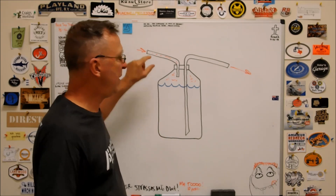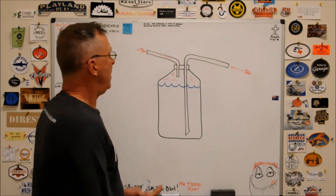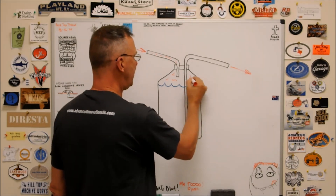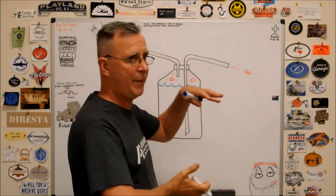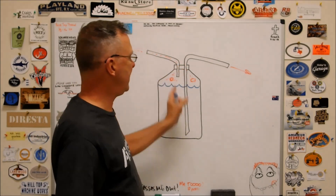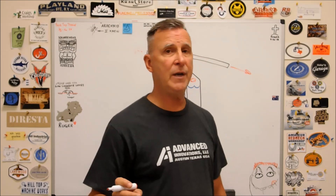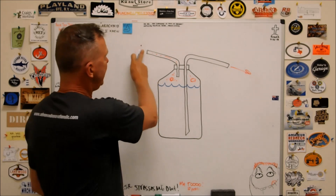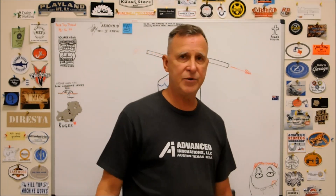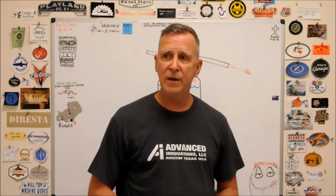Seems simple, seems legit. I'm going to put an air hose on here. I'd really like to hook it up to a regulator, but I don't know that I have the time to mess with valves. One problem you will encounter: as the air pressure in the vessel increases, it stays compressed because air can compress, but liquid can't. So even when you stop the flow of air, the pressure is still going to pump liquid out. If you want to control it to the nth degree, you'll need a way to bleed the air pressure off — either by disconnecting the source or putting some type of little rubber flap on the inside. Let's take a look out there. I'll show you what I did, how it performs, and put something in your mental toolbox that might help you in the future.